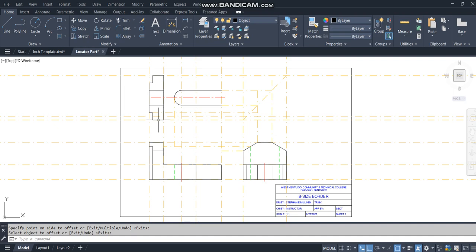So now I can go through, take my object line all the way over to that edge, draw a new line that goes from that 1.75 over to that 0.25 that I just created, and then up to the open slot. Do the same thing on the other side. It goes down to the 1.75. And then I didn't draw the others, so I'm going to again use my mirror command. Use some of these tools as we go through these drawings. The very center part, or midpoint, create along that center line, and it mirrored the top half. So I didn't have to draw all those lines independently.